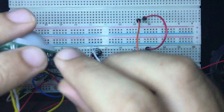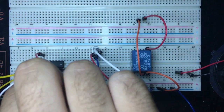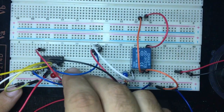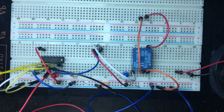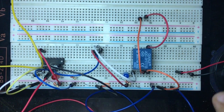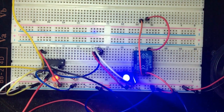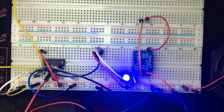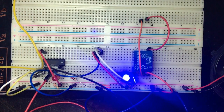I've set the potentiometer to minimum pulse time. I'm connecting the LED to the sensor's OUT pin, with the other leg to ground via a 220-ohm resistor. After powering up the circuit, the sensor needs a calibration period of about 15 seconds to settle down.